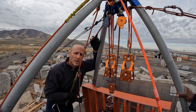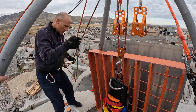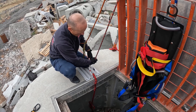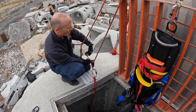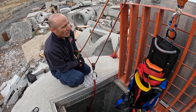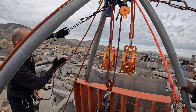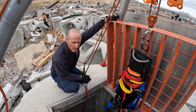If I can take advantage of something called a butt block — a pulley rigged low within the footprint of the tripod — that's awesome. I find some sort of anchor in the space, attach a pulley, and it becomes just another directional still going out to the haul field. With a two-to-one or three-to-one on top of that, it becomes a compound four-to-one or six-to-one system, and the resultant now doesn't matter nearly as much. The resultant becomes more centered, and there's no way it gets outside the footprint. This applies to all rigging options.